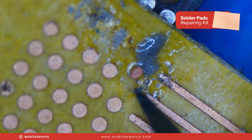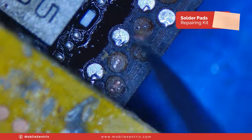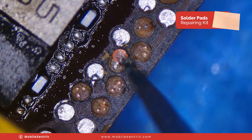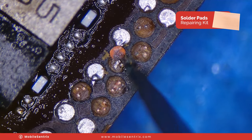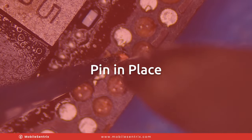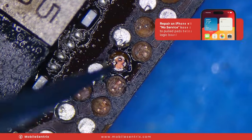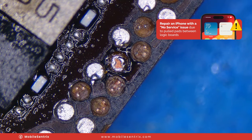Not a lot, just a little bit. We'll carefully peel this off, flip it over so that the solder is facing down, then pin it in place so it doesn't move, and touch it with the iron. Now it's not going anywhere.